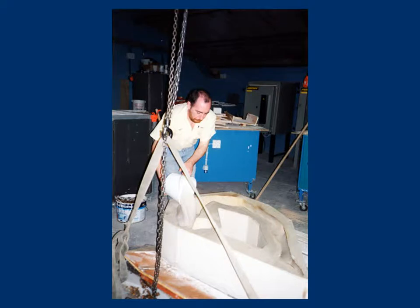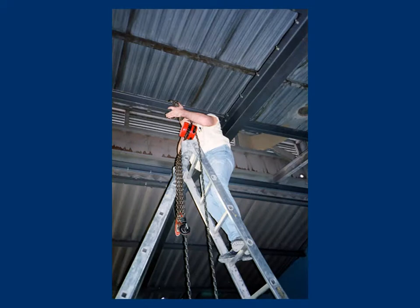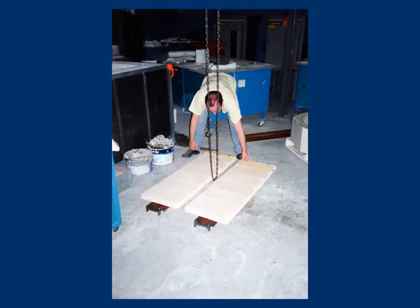In order to adjust the exact amount of crystal necessary, the volume of the sculpture has been defined by filling it with silica. The hoist is repositioned to enable introducing the piece in the kiln. We decided to resort to U-shaped metal construction bars because of the strong thermal gradient we noticed, thanks to temperature measures with cones and optical measures.